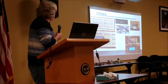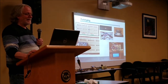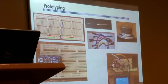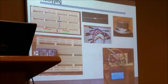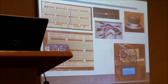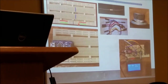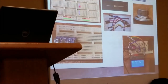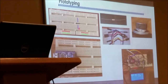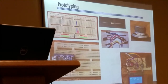The red and green lines on the breadboard run across the strip but stop at the center black line — so you have a set of terminals connected on one side and a mirrored set on top. The blue line stops in the center of the board, giving you five terminals connected on top and five on the bottom. That makes it nice to plug in an IC or a Nano and still have room to hook things up.